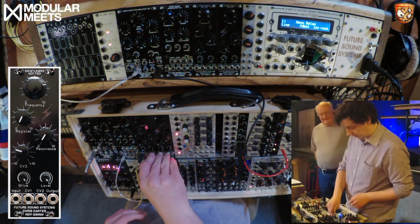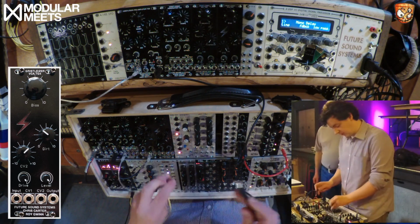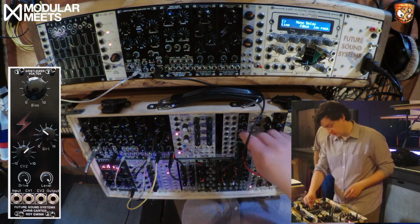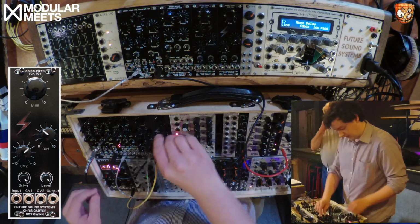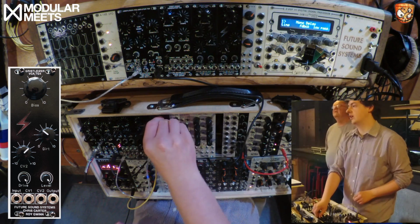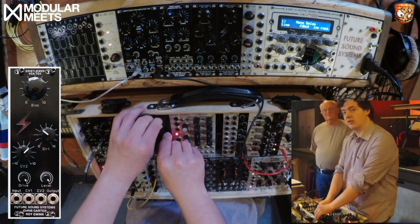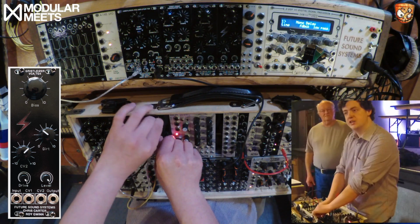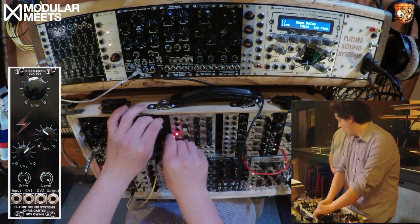So what we'll then do is, at the moment, I'll just switch the input and output over to the modulator, which is essentially the VCA. So we've named it the modulator after amplitude modulation. And taking the dirt down, you'll hear that we get quite a clean VCA response from that. I'm just tweaking the bias there. If I start bringing the dirt up, it gets more and more of a harder edge, until you get quite a harsh cut-off on the VCA action.